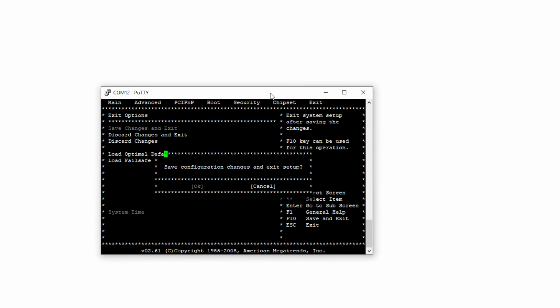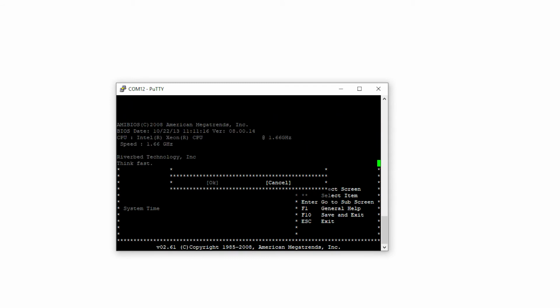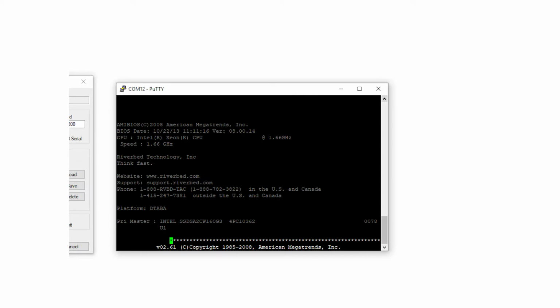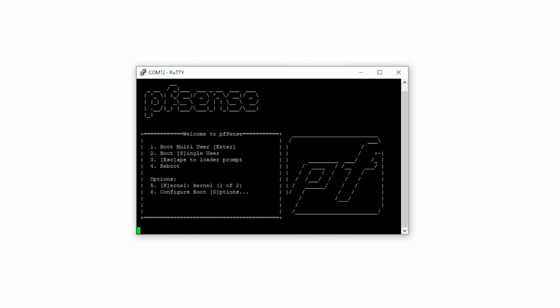But you want to stay on this baud rate for a little bit longer just to make sure it's doing that. The way that you can make sure is that you'll see some funny characters starting to come up. As soon as you see that, you immediately have to go into 115200 baud rate as quickly as possible. There we go, we see it. So I've got a window already open, ready with the 115200 baud rate, and I just pressed open on it and it went straight into this window.